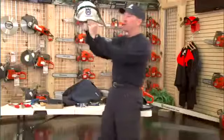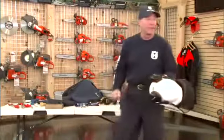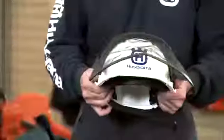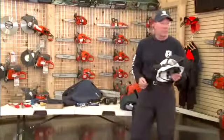That tells you the helmet is good to go for the day. A key feature of a hard hat is a gutter system. The gutter system attracts rain, pulls it from the back to the front of the operator, and drips it down the front of your body instead of going down your back, down your legs, and into your feet. Cold, wet feet create distraction, loss of focus, and a higher chance of injury. It's a minor thing, but it's a big thing — having a gutter system on that helmet.